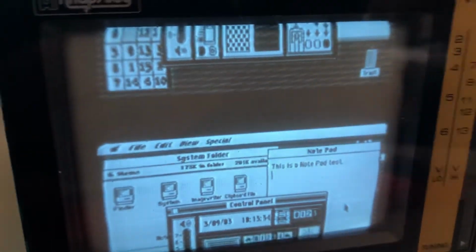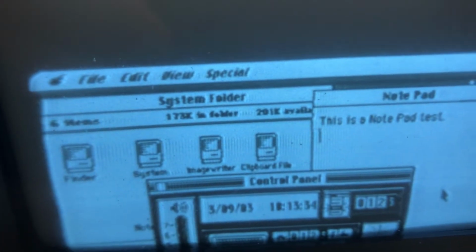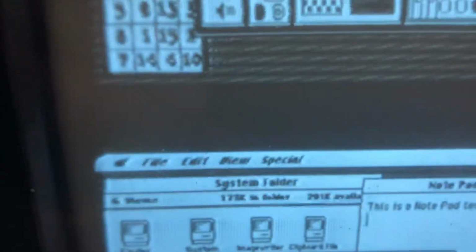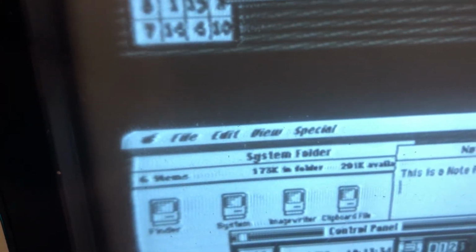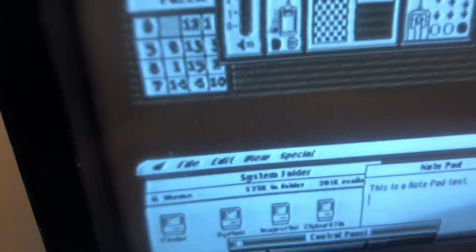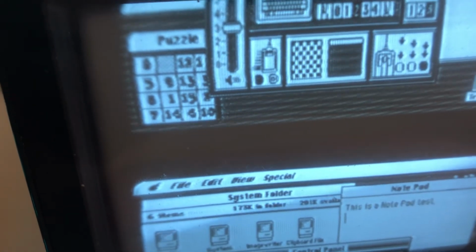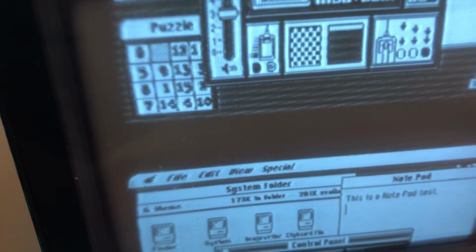So this is a screenshot running at native 1:1 resolution, coming off some Mac Plus or something like this, a random screenshot I just pulled online. You'll notice there is distortion on the menu bar. It's not horrible, but it is definitely a concern, and it's completely based around issues with the CRT itself. Usually this falls into the overscan. Because I'm using the full size of the raster, it shows up on the main image and is definitely something that needs to be compensated for.